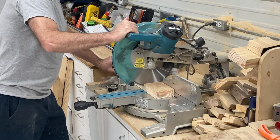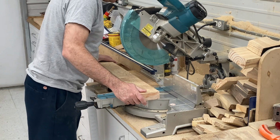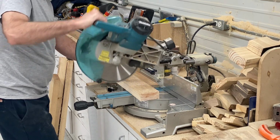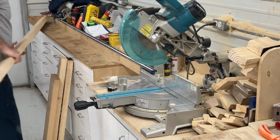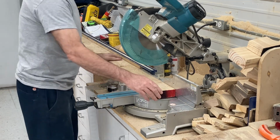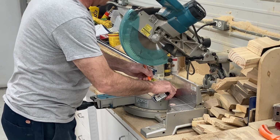By the next door, which isn't in this video, I decided to just take a couple of blocks of 2x4 and put them kind of semi-permanent on my fence on both ends of the board. I'm starting out cutting the joint without the spacer in there so that I get a more accurate square cut, and then putting a little plywood shim in there, and that gets to be pretty tedious. So I upgraded to those blocks of 2x4 held on there with a couple of spring clamps, and that worked a lot better and more efficient, but I wasn't videoing at that point.